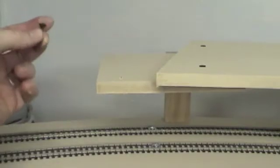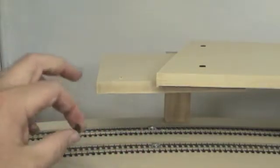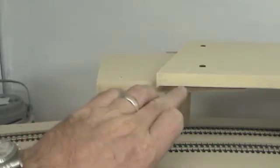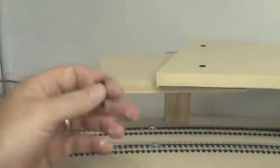I'm using two one-inch screws that go through and just barely stick out the bottom so I won't have any clearance issues. What I do is when I paint this MDF — and by the way, I just got a can of paint at a garage sale, the guy just gave it to me — I paint these parts, let them sit out and air dry until the paint is almost dry, maybe a little tacky, then I put it up on there and screw it together. That really holds the two pieces together quite well, along with the four screws per section.